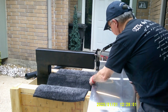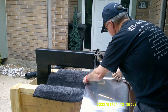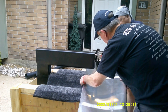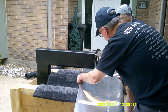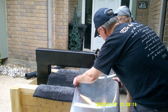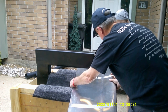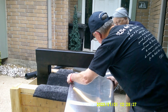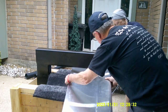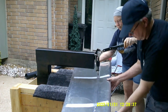Between bending and lining up those dies to match the holes, it looks like it's very labor unintensive but it really is - it takes a lot of detail work because you're trying to do both at the same time. When you get old and crusty like us, our eyesight's not quite as good as it used to be, so you've got to get down in there, line up that die, and at the same time bend out the skin so you can get those dimple holes.